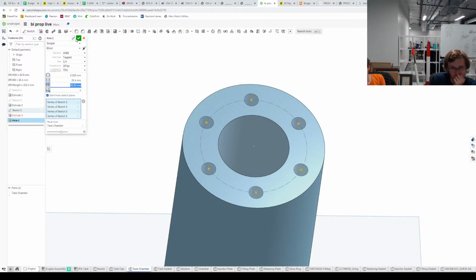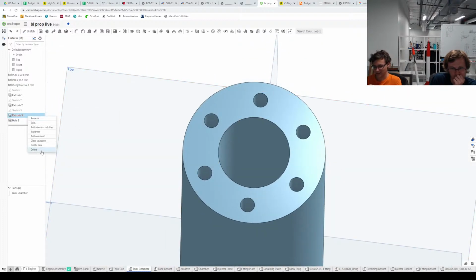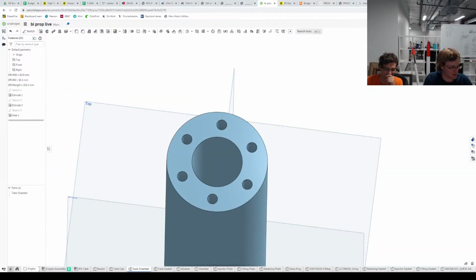Actually, maybe now it doesn't have to be. We were playing around with some different designs before this one, and some of the geometry required that we have 2 pieces. I still think it should be done in 2 pieces. There's some weird setup going there, and to drill these angled holes, you'd have to drill that quarter inch of aluminum with that super small drill bit. So you would move this guy down here, because you want that flat to start on. We're pointing at things, and the stream is not understanding what's going on.